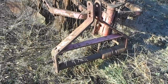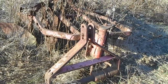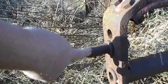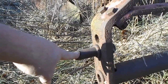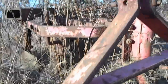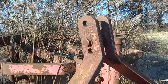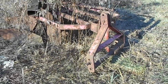The big thing you'll notice is it's got a full three-point tree on it. When it's hooked to the tractor, this top pin becomes the pivot point. As the tractor pulls the plow along the ground, it pulls that way, which pulls your center link — and that activates your draft control. It's just as simple as that. That's what this plow is designed for.